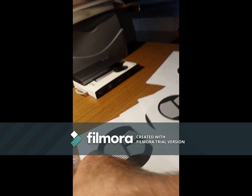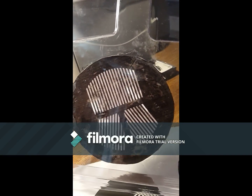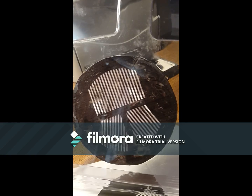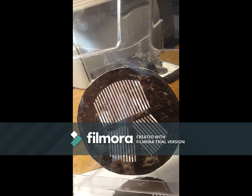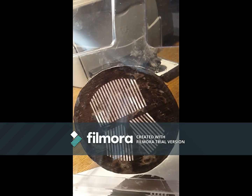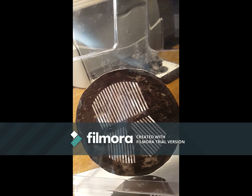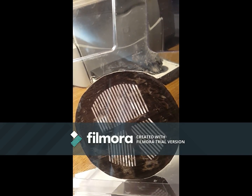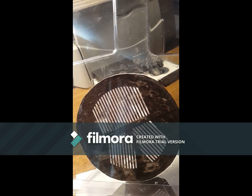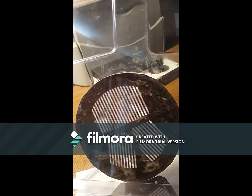I took a heavy piece of plastic and super glued the template to it. Then I'm going to take my Dremel and cut those lines out — white goes, black stays. It doesn't matter that it's super glued to the plastic because you're going to paint it black anyway. I don't know if you could cut that with a razor knife since those are awfully small lines. This is going to be the first iteration — there might be more. Hopefully this will give me my Bahtinov mask for my Short Tube 80.